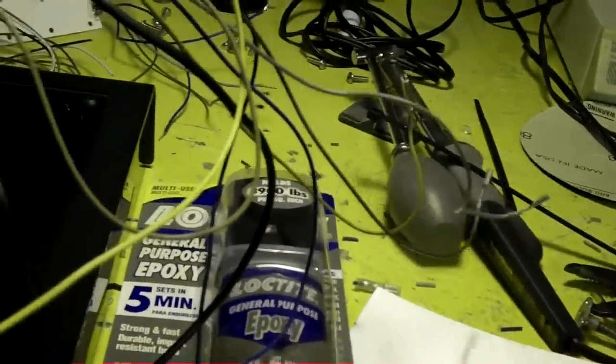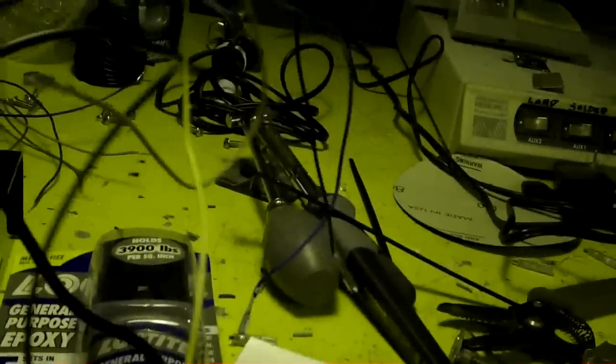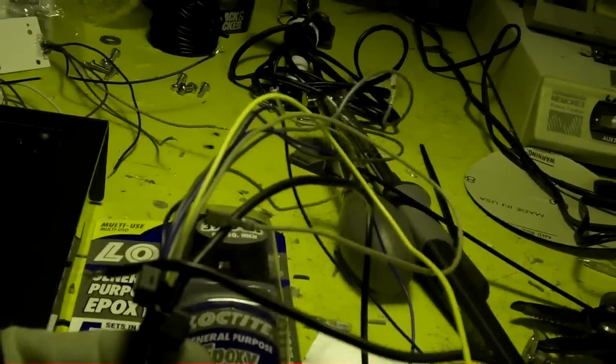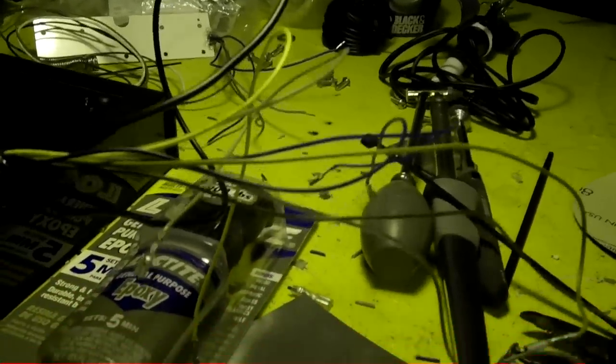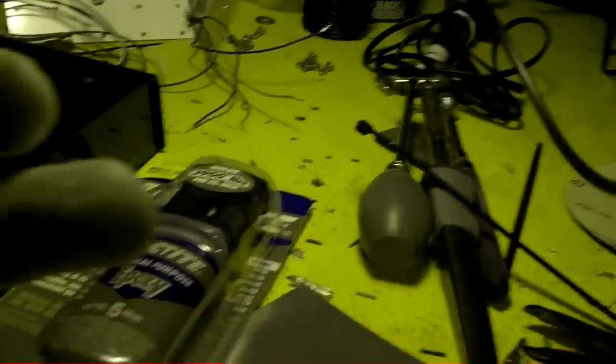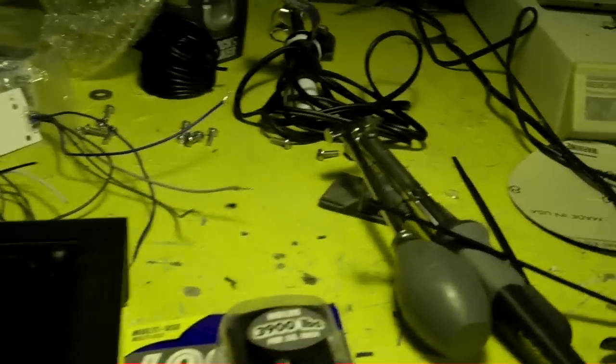this is the ground wire harness. What I would normally do, like in a USA style arcade cabinet, is a daisy chained ground wire harness, where it's just one to the next. But these Japanese sticks always have an individual ground wire for every single button, which is completely unnecessary because they all go to the same part on the board. So they all come together in this one giant solder with a ground wire coming out. So this is all the ground wires for the buttons. And the joystick's pretty simple here. That's just standard, just the wires that were there cut off, and I will just put them right in.